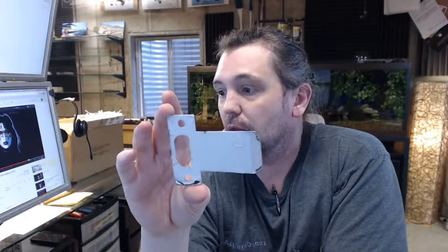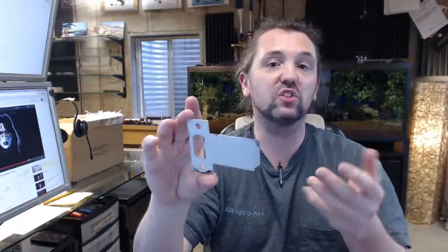T-Strikes are commonly used when you have an installation where the door is set deeper into a frame than standard, or you might have applied molding on the pull side of the opening such that the lip of the lock would make unintentional contact with the face of the casework, frame, molding, or trim prior to engaging properly. Another instance is where you have cabinetry in a kitchen with a pantry where the outside of the door is made to look like the rest of the cabinetry.